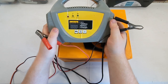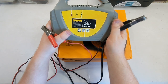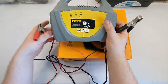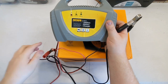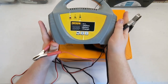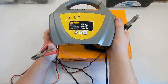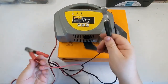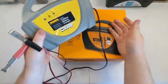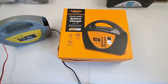It was at about 11.1 volts, and when I disconnected it dropped down to about 10. I did a bench test — just plugged it in and ran my multimeter across the terminals with no other load on it — it's only putting out 11.4 volts. So it's never going to charge a battery. We're going to discard that. I'm not throwing it away, but the internals of a battery charger are beyond my capability to fix, and doing it wrong risks fires. What I might do is turn it into a low-voltage transformer for small electrical projects — basically a 12-volt supply on a test bed.